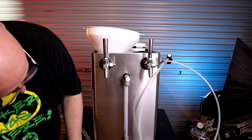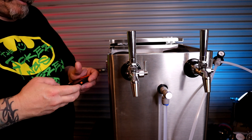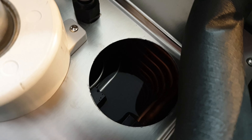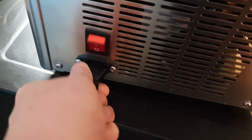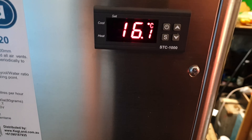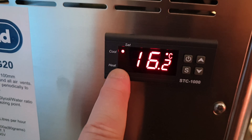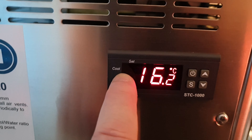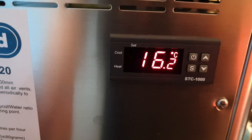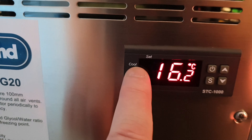Today for this test I'm just filling it up with water. You can run with water but you can't set the reservoir under 2 degrees just in case it freezes. If you're using glycol you can go much lower. You can see the water on the sight glass — I lost count of how many jugs I put in, must have been around 12 to 15 litres. If you haven't used an STC before, I do have a full video on usage. When that cooling light is flashing, that's a time delay for the cooling cycle to protect compressors — it usually takes about 2 to 3 minutes.